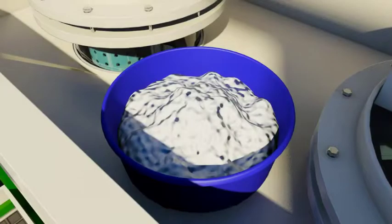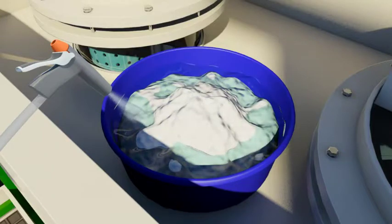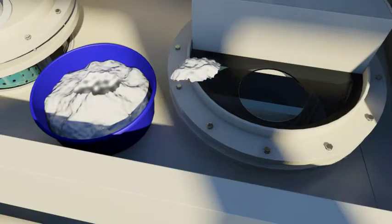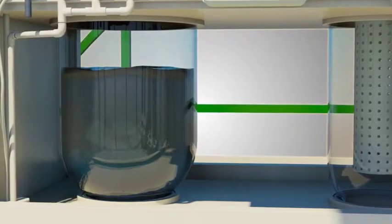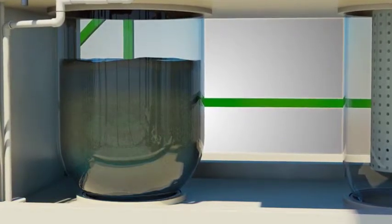In the precipitation reactor, sodium metabisulfite is added, mixed with water, either manually or by an automatic metabisulfite loading system. For manual charging, it is done from the top manhole on the reactor, whereas for the automated system, the redox pH probe detects and indicates the pH, which has a digital process controller and activates the pump to charge the right quantity of metabisulfite solution. In both cases, the changing color of the solution is the best indication to finish the charging.